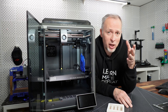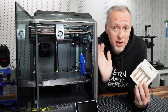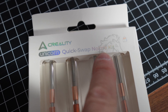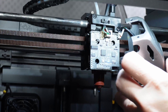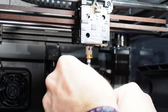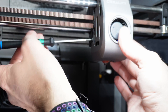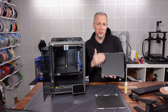We will review these new nozzles in a separate video. Creality announces this as a quick swap nozzle system, but honestly it isn't exactly quick swapping — before you can swap the nozzle you have to take off the extruder cover, remove the heat sock carefully (otherwise you can destroy it), then screw out the nozzle with a tool, screw in the new nozzle, put the heat sock back on, and put the cover back on with two screws. Also worth mentioning: Creality ships this printer with a metal sheet PEI smooth plate called the A plate.